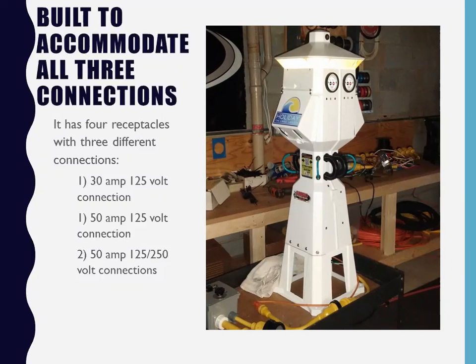They just built a brand new fuel dock. They're running a brand spanking new 100 amp service to the fuel dock devoted to this pedestal. This pedestal has not been installed yet. It's getting done this spring. The best part about that is that it's got a clean ground system. It's not at the end of some dock that has 100 other boats tied in, you know what I mean? It's got its own 100 amp service with its own clean ground system.